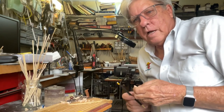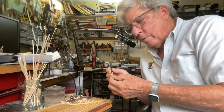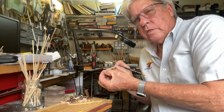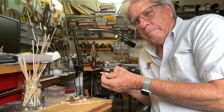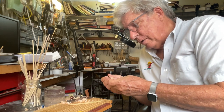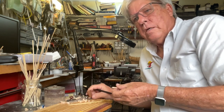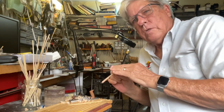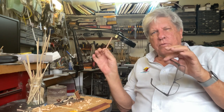The nice thing about this build is I'm constantly learning as I go along, especially when doing new things. Tapering these pieces and taking the time to draw the lines on the side to show the taper — I found that I don't need to do that at all. Having established that the top piece is 10 inches, the bottom piece is 7½, and the middle is my 9-inch mark, I can just plane it until those marks disappear and I'll end up exactly at the same point. You can't see the line anyway, so it's very problematic to keep trying to highlight it. The only trick is to make sure the plane is level at all times — you get an indication of that if you start to see the lines at either the bottom or the top start to disappear partially. Now that I've got this down, it takes 3 or 4 minutes to taper the piece before the octagon shaping.